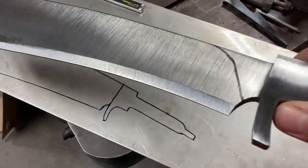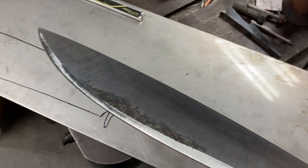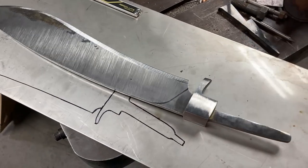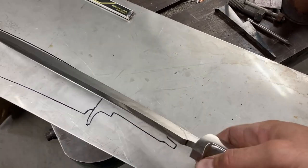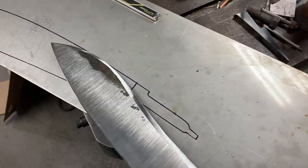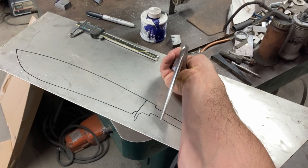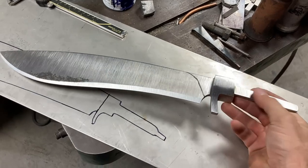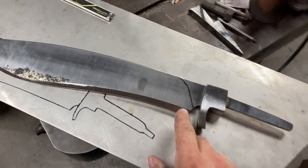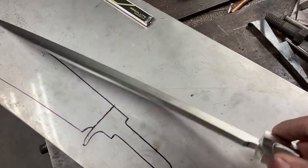One progress report — okay, so you can see we've got a pretty even edge, a little facet here and there, nothing too major. Pretty even starter edge ground on here all the way up through the tip, both sides. It's pretty even in thickness along through here, so it's about 60 thou all the way down. Let's see if we can sight down it on camera here — pretty nice and straight all the way down that edge. I'm going to call that good for a starter bevel, then we're going to start working flats all the way up to the spine, get rid of all this, get close to our plunge cut, and just take a bunch of meat off the blade, take a bunch of weight out, and really start to define these bevels.